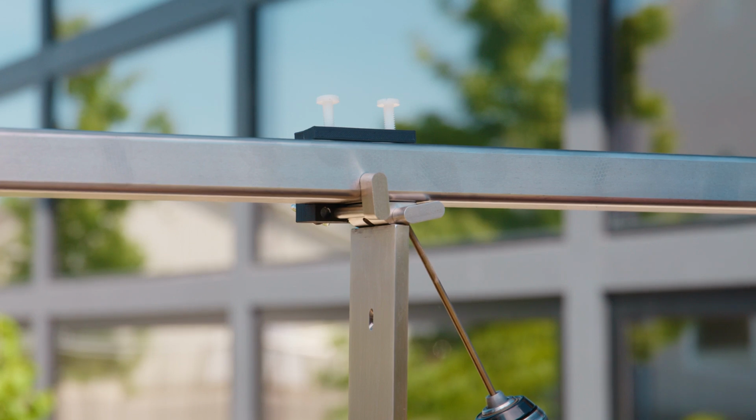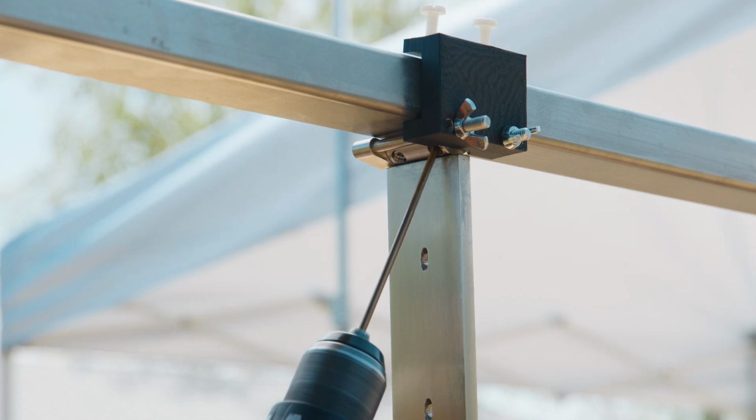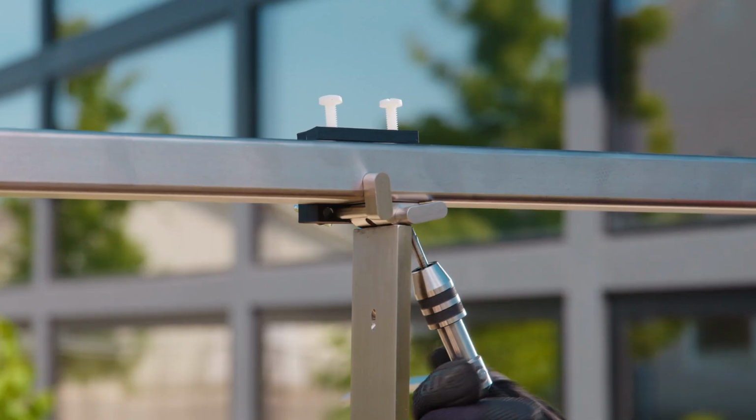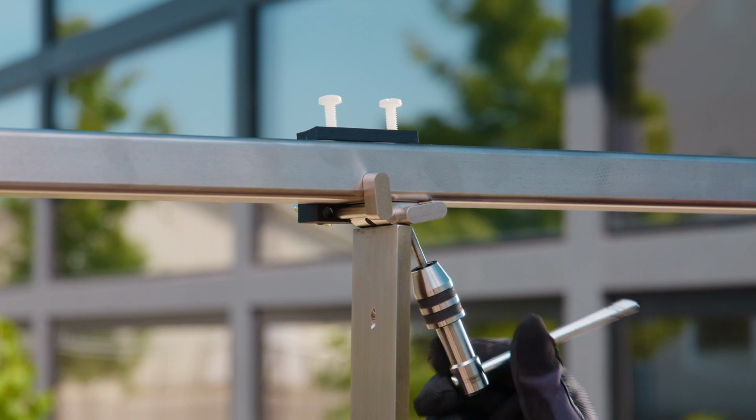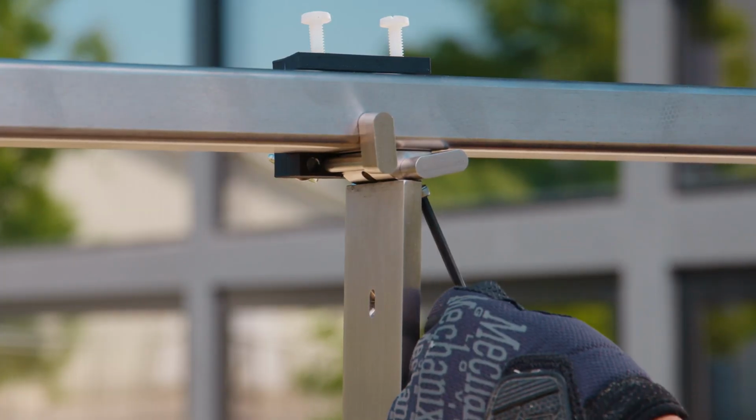With our handrail and post top clamped, we'll drill and tap one pilot hole using the same tools as earlier. You can see here, we're just going right through the holes on the post top itself into the handrail. We're just setting it with a single screw for now before we confirm the final placement. We'll repeat this process on every line post.